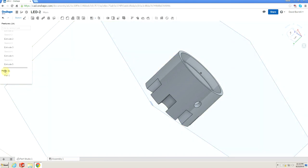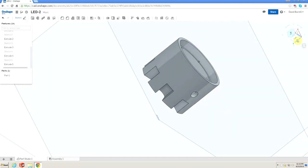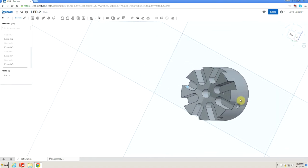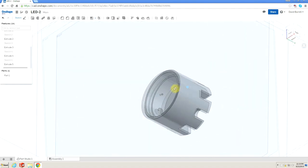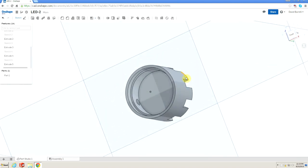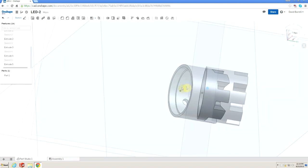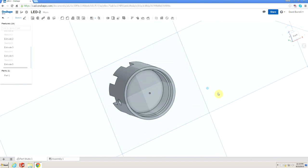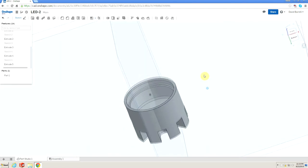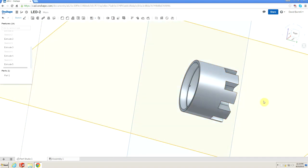A lens for this would be really easy — just a disk that's one-eighth of an inch thick. You could save this as an STL file if you have access to a 3D printer, test print one, mock it up, make sure everything fits correctly, and do that before you set up the CNC job and CAM the part. Since this is one-inch bar stock, whether plastic or aluminum, I have a 5C collet holder — we'll put it in the 5C collet and work on it that way. The fixture fits on either of my CNC machines. Hopefully we'll also be able to do some engraving on the outside.